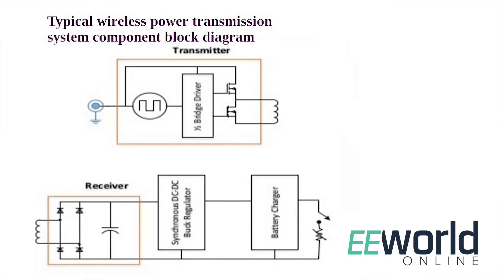So why does the toothbrush boost the power frequency so high? The components you need to work at 100 kHz power are a lot smaller than those necessary for 60 Hz power. All electric toothbrushes that I know of, not just this particular model, boost the power signal up to at least the range of tens of kHz to keep the components on the handle small.